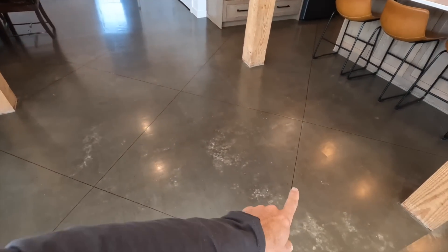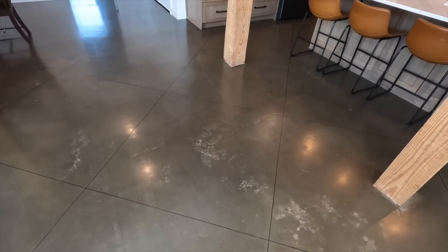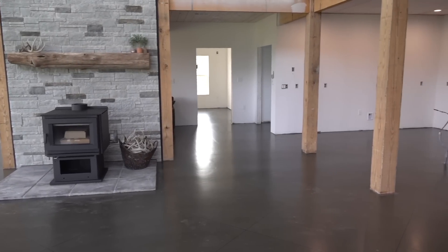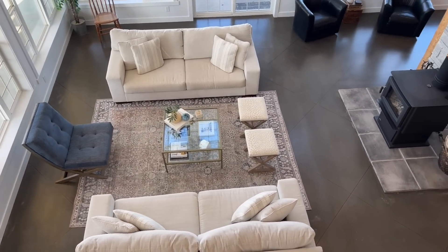You can see right there where one batch ended and a new batch started — it ended up a little darker. I never notice it anymore, but it really bothered me at first. As for the four-by-four squares we cut and filled with grout, that's amazing. Overall it just wasn't the look we were really wanting. The color of your concrete is going to be affected depending on what sealer you put on. The biggest shock for me was that I didn't fully digest that the epoxy would darken it as much as it did — it looks like wet concrete forever.